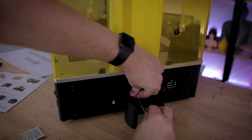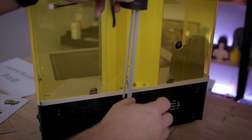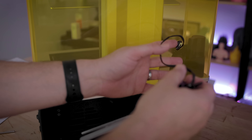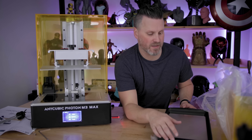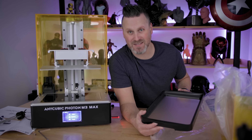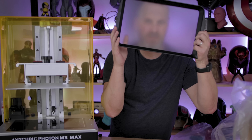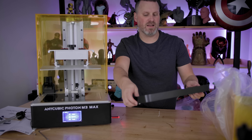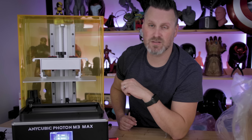The next thing we do is install the back cover by screwing in some bolts. On the back of the printer, we're going to install the holder that will hold a bottle of resin for auto feeding into the vat. I'll have a bottle of resin back here, put the cap on, run the wire through the opening in the back, and connect it to the auto feeder. Before installing the auto feeder, I want to run a quick test print to make sure everything is calibrated properly and level. One interesting thing to note about the new vat is the FEP sheet isn't completely translucent. The vat also has two little plastic feet to keep the FEP sheet off any surface and to make aligning the vat into the printer much easier.